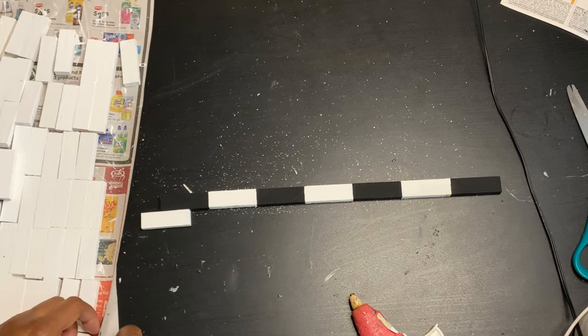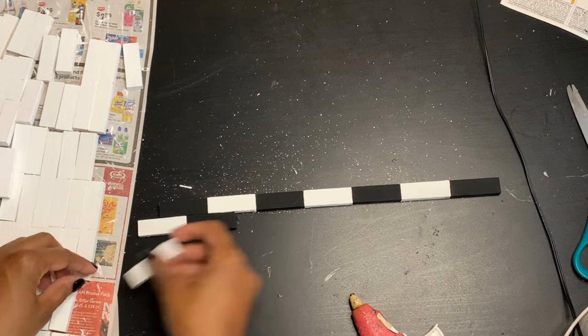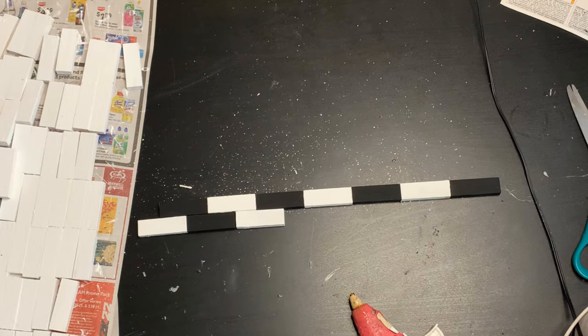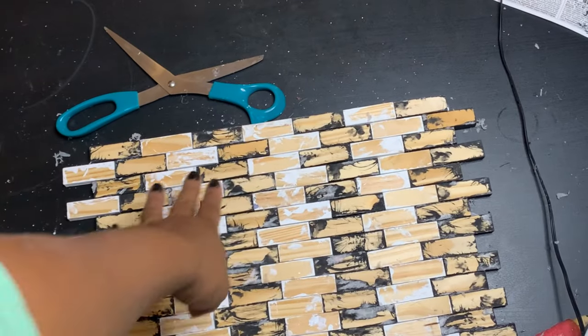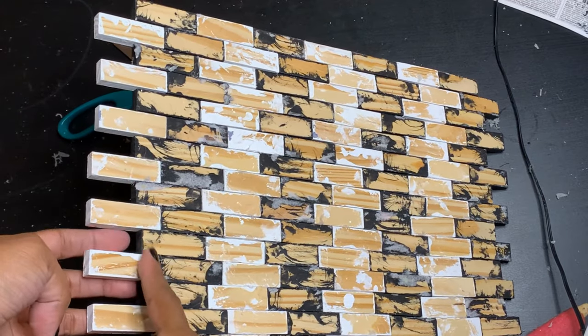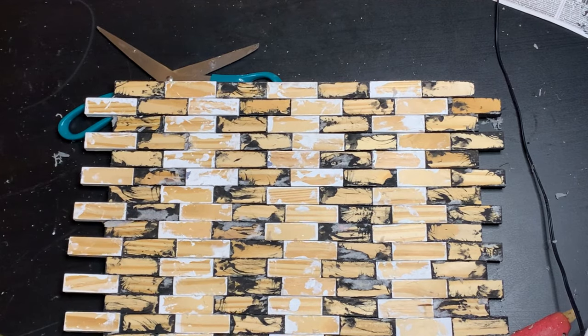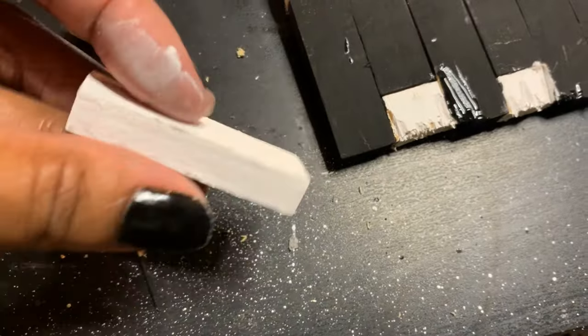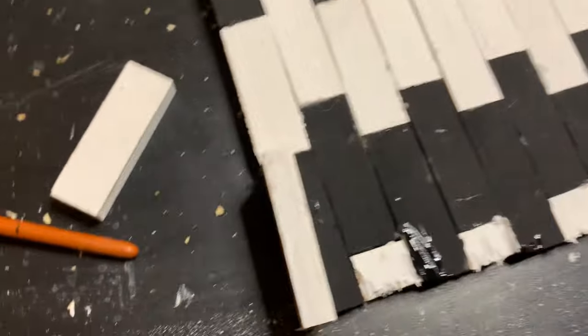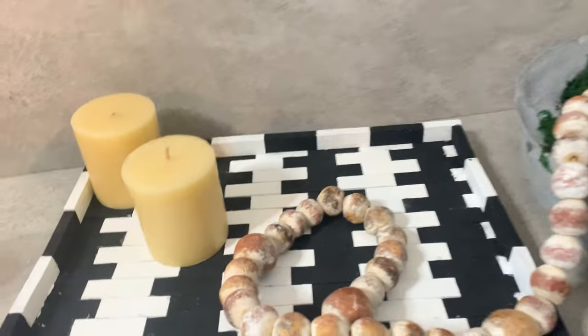Then you go on to the next row — you can do the row separate and glue it together, or button it up and glue as you go so everything is connected. I then cut off the edges. You're going to want to cut upside down if you're using a saw, because I cut one side the other way and it splintered. So cut upside down for less splintering. Then just do the edges — I did mine raised so it could be as high as possible, alternated the colors, glued those on, and this is how it turned out.